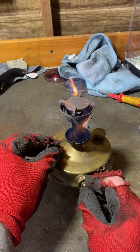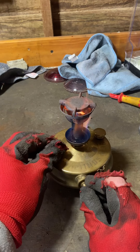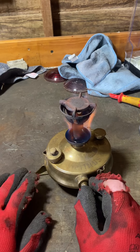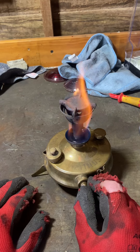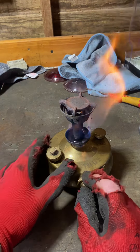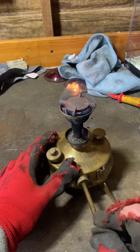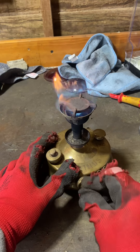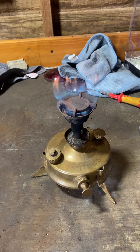Obviously now that's done. We're just going to drop back on the air a bit, so we're going to kill the flame a little bit, and then we're just going to let the methylated spirit do its thing — just let it burn away a bit, or else you'll have flames all over the place. That's nearly gone, and then we'll start pumping away. As you can see, straight away it's fired up perfectly.